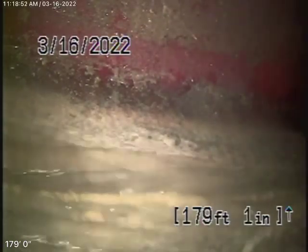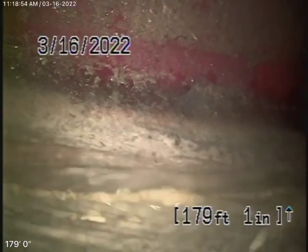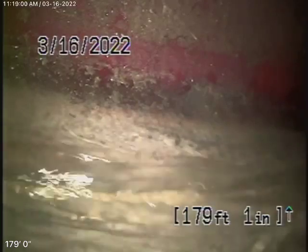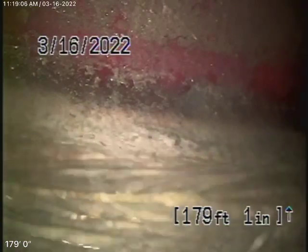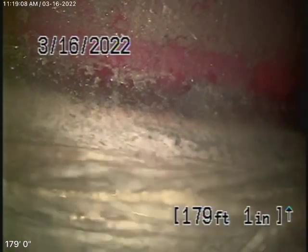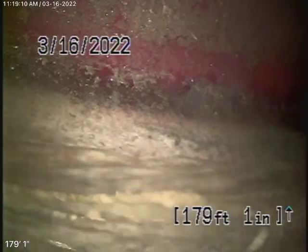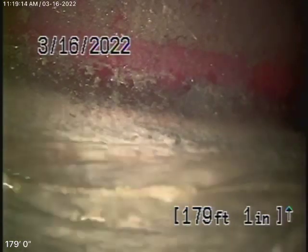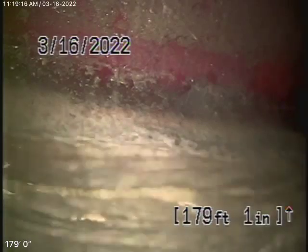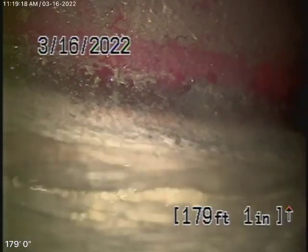Now, there are a little bit of roots along the way which we're going to clean up. We had a tough time pushing our camera in all the way to the city. You can see the city sewer there, so we don't want to keep pushing the camera back and forth. Just understand that the sewer line has a tremendous grade going downhill all the way to Queen's Road, and you'll obviously need some periodic cleaning, but we pretty much got it.